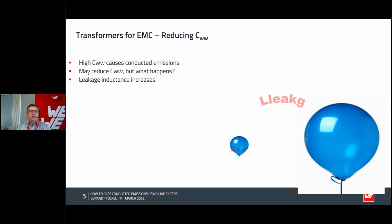Now you don't have to fight for the capacitor. You have to fight what I'm doing with the leakage inductance. You have to make an excellent, good snubber, but you effectively destroy energy in a snubber. So this energy doesn't come from a parallel universe. It will cost your efficiency.